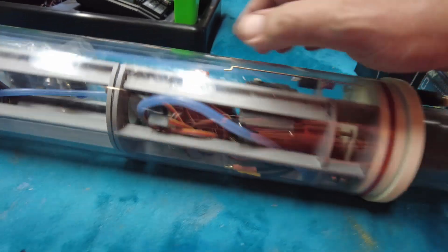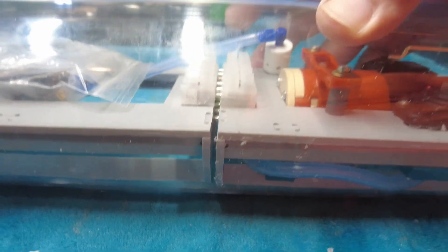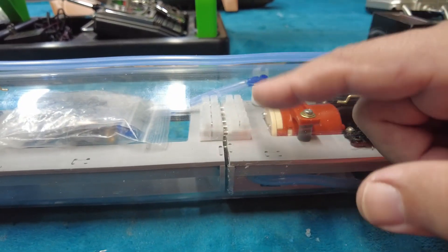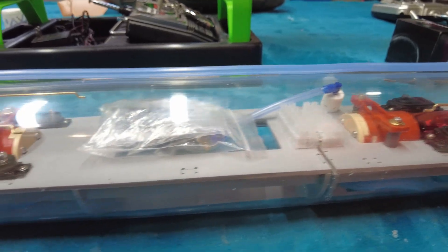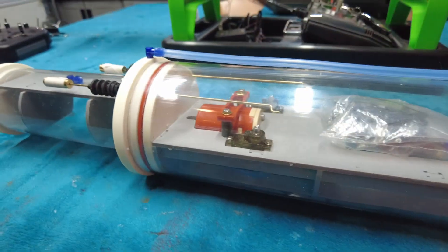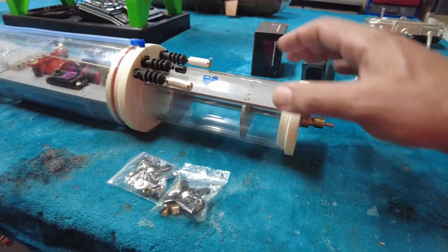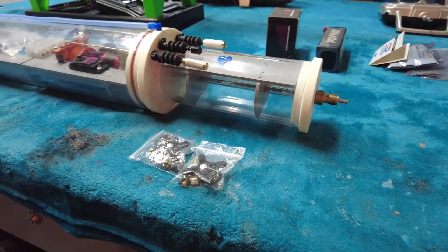Big battery pocket on the inside. This in the center is the secret sauce — this is the interface between the forward and aft bulkheads inside so that you're not making up and breaking apart wire connections. That's pretty slick, although it takes a little extra work. Then we've got forward servos, two forward servos, and our forward ballast tank pump. I think these are both 750 mil ballast tanks, so about 1.5 liters total ballast tank capacity.